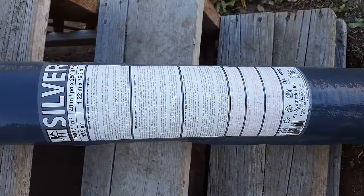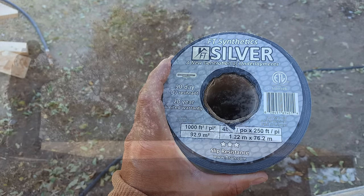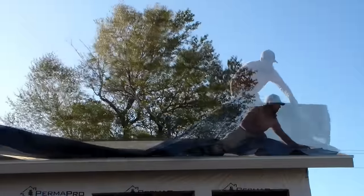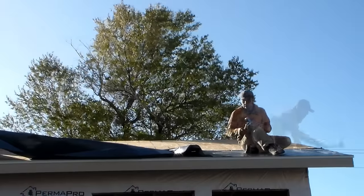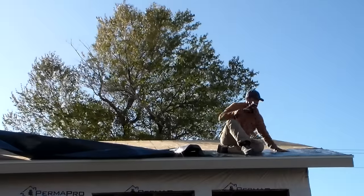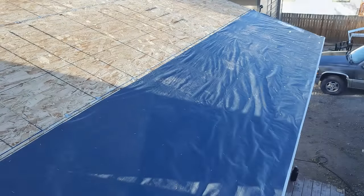Now let's move on to the next step, which will be the underlayment. There are many different types of underlayment available, some with thicker padding for soundproofing, and some with slip resistant surfaces, such as the FT Synthetic Silver, which also has a thin felt backing that offers a small amount of sound dampening. This comes in four foot rolls and covers approximately 1,000 square feet. With the underlayment, I start at the bottom first with a slight overlap on top of the drip edge, then work my way up to the top. To secure the underlayment to the sheathing, I'm using a hammer stapler with three-eighths of an inch staples, hammered every 12 inches or less going both directions.